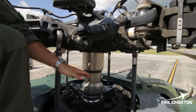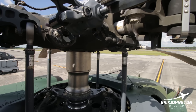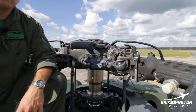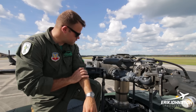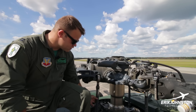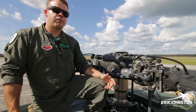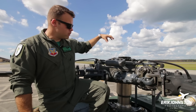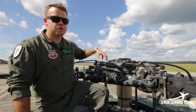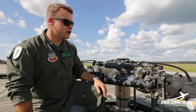The original 60 was not designed to have this mast extension — it's all titanium. Originally the rotor head would have bolted up right down here, but they encountered a lot of vibrations in flight testing, so their fix was to extend it with this rotor mast extension and pitch change rods. When they had to put it in the C-130, they'd loosen it up, remove the extension, and bolt it directly to the swash plate — making it air-transportable, though it added a little too much height otherwise.